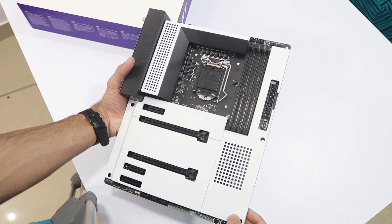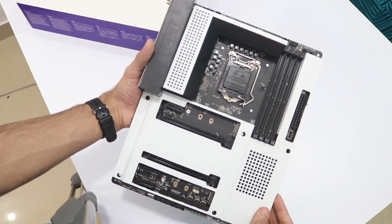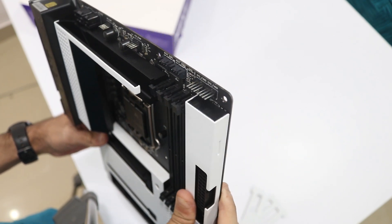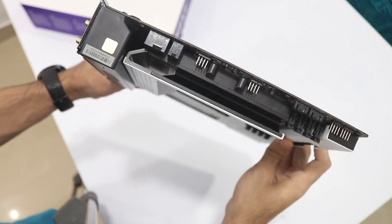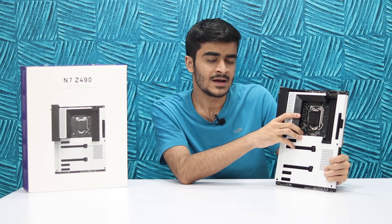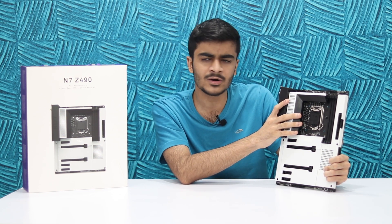On the technical side, you've got four RAM slots, your CPU socket, and the VRM heatsink on the top. The VRM on this board is decent — nothing spectacular but not bad. It's an 8+2 phase system with an ISL 69269 PWM controller handling 10 SIC 632A 50-amp power stages. In my opinion it could be better — there are other boards for enthusiast builders at this price range — but it's decent and will get the job done even with an i9.